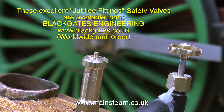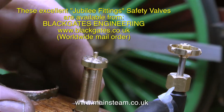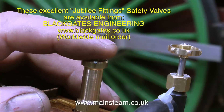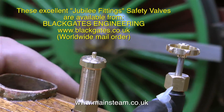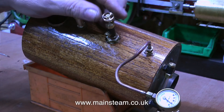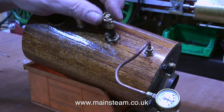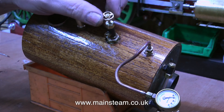To evacuate the steam from within the hull I'm going to make a fitting that slides over the top of this safety valve, held in place by a couple of O-rings, just like I did before when I rebuilt one of the other boats for the same customer. The boiler is all ready for steam — it's completely airtight. When I disconnected the air supply and shut the valve, the pressure remained at 60 pounds per square inch, and when I opened the valve, obviously the pressure disappeared.